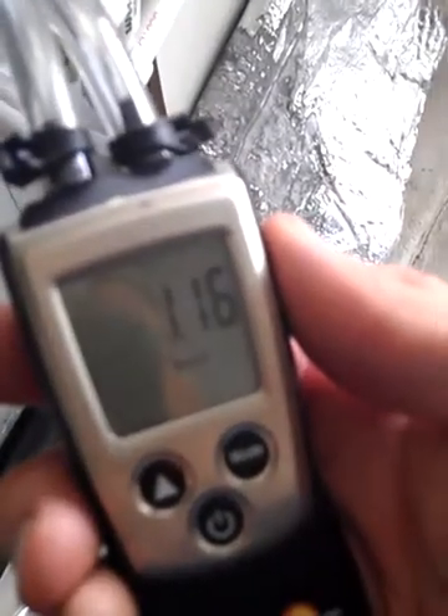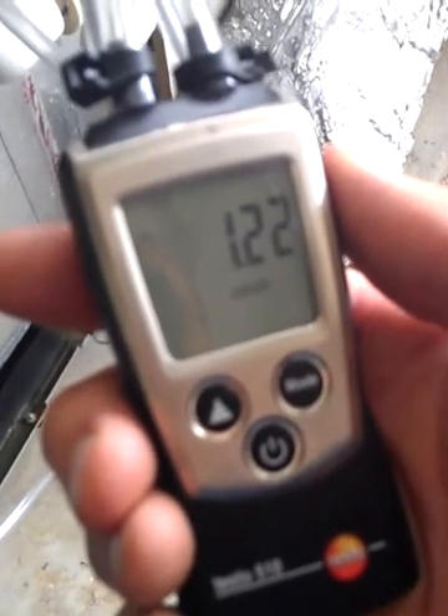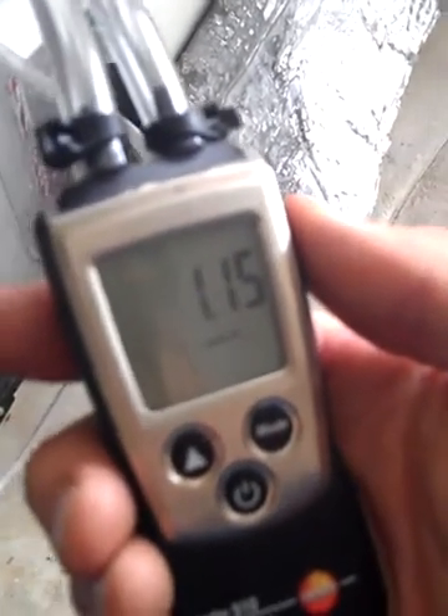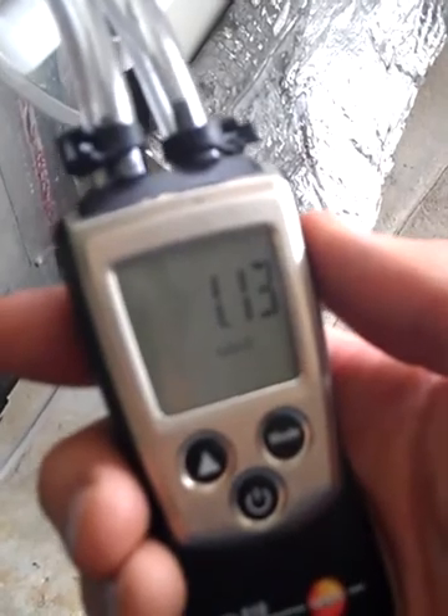This is not going to be perfect because we don't exactly have it in there. What's happening is this variable speed — I only have one zone call in the smallest zone, and we're up at 1.2, 1.3. The variable speed says whoa, and we hear it clicking going on inside the cabinet, so it's ramping up and down. It's having some trouble holding its amp draw up that high. Before it was going all the way down to 0.8 and up to 1.2. So we've got a really bad one here.